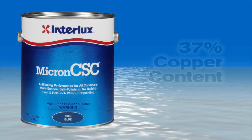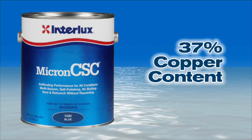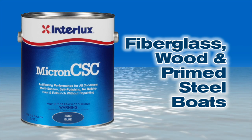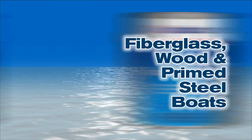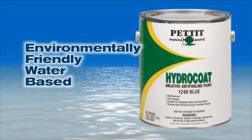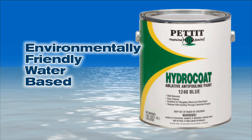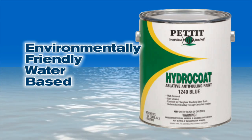Micron CSC is a quality paint which has proven very effective over the years. It has a 37% copper content and can be used, as each of the paints we have mentioned so far, on fiberglass, wood, and properly primed steel boats. Petit Hydrocoat has a slightly higher copper content at 40% and offers the added benefit of being a water-based product. This means it's not only more environmentally friendly, but also has fewer solvents and less fumes and easier cleanup.